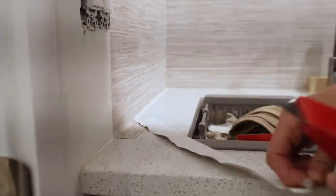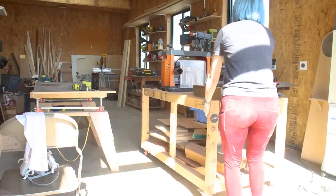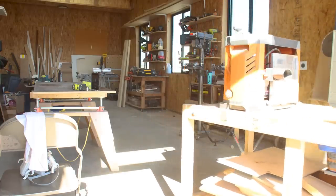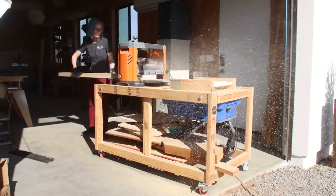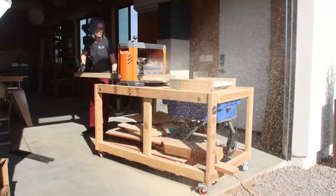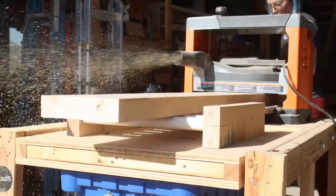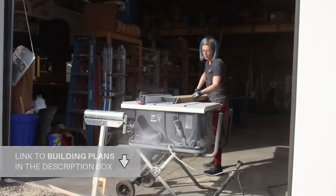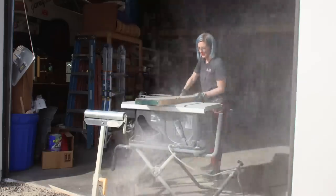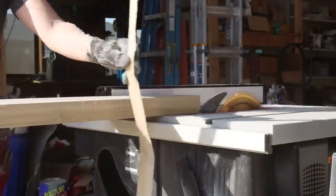The next day I began working on the solid poplar floating shelves, which meant I got to pull out my double-ended flip-top workbench and my thickness planer. Most of the time when you want to use solid hardwood you're going to have to do a little bit of preparation or milling before you can use the boards. These 9-inch wide, 8-quarter poplar boards were S2S — surfaced on two sides — when I bought them, but they were far from smooth enough to use. I ran them multiple times through my thickness planer and shaved off a few millimeters from each side. I highly recommend building yourself some outfeed rollers if you're going to be planing down heavy, long boards by yourself. Once the thickness was slimmed down to about one and three-quarter inches, I took them to my table saw to trim off the rough sides and rip the boards to their final width of about eight and a half inches.